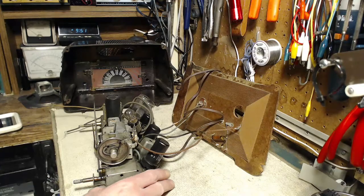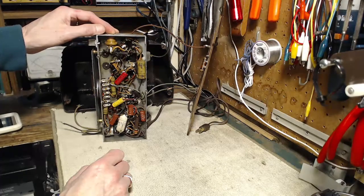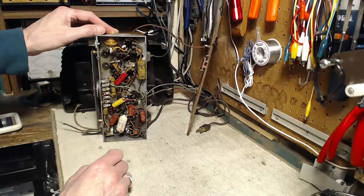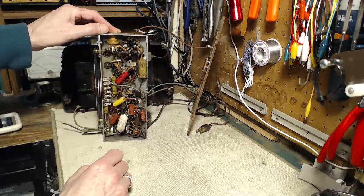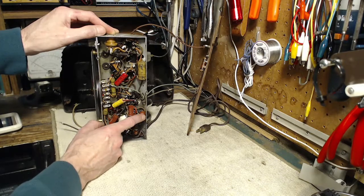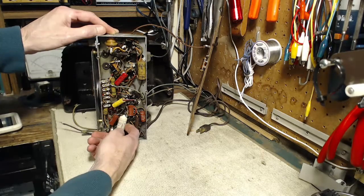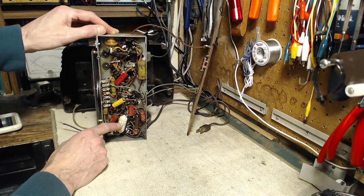It's a big light. Let's see underneath. Lots of work has been done under here, I think. This certainly looks like a fairly new capacitor. It has a bunch of Hunt pre-molded capacitors which are, I believe, known to be not too good. I've got this big one here — a 0.1 microfarad 600-volt capacitor.